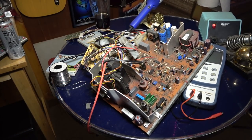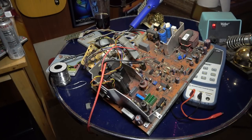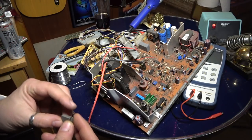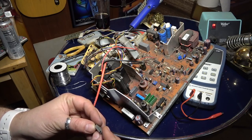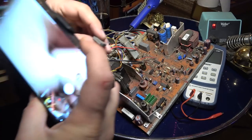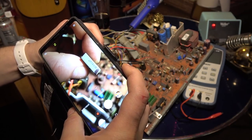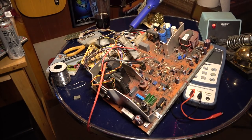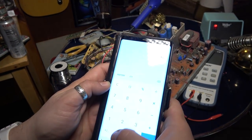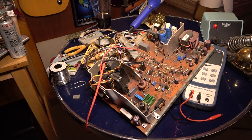That is 175. Let's take a look down here. Yeah, that's C175. So that's the last one according to the FAQ you need to check. So it was 172, 174, 175. All right, so let's test out this one. So this one is 0.012K, 630 volts. So if it's 0.012K, that would be, let's see, 0.012 times 1,000. So it should be 12. Is that what I'm getting out of this?